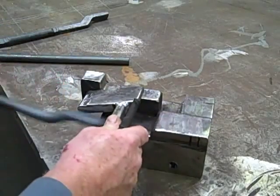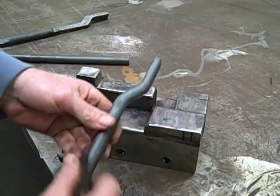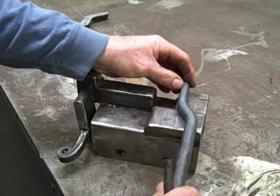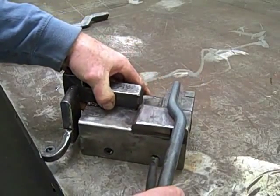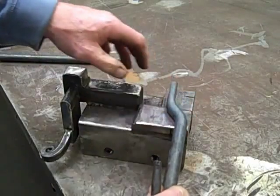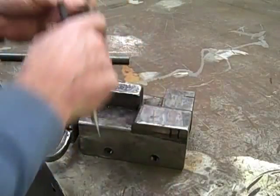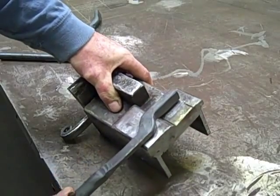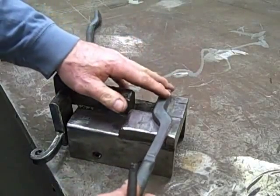After driving that down, I remove the arm and take the piece we've just bent, putting it on this block. I have another arbitrary line back here. I'm going to come into that point with the top end of the boss toward the outside and drive that down. You can see how it's offset right in here — that's our radius on this piece of the die.